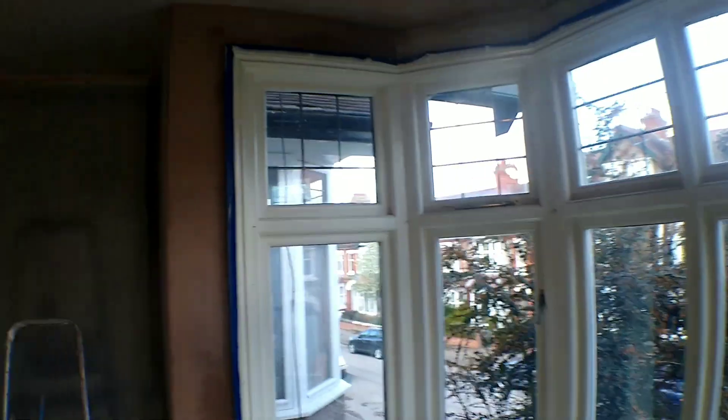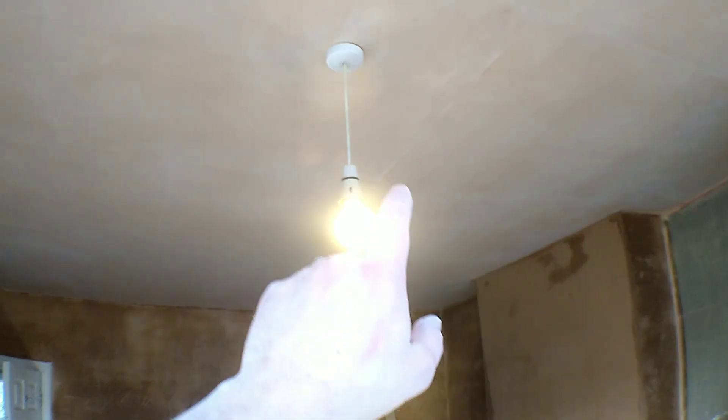That's what we've been doing. As you can see, this master bedroom is almost finished, and you can see this ceiling drying out. This ceiling has been overboarded with a 9.5mm plasterboard because it was papered, and it made more sense rather than spending hours and hours stripping the ceiling and priming it all. In this case, we just overboarded the ceiling. So there are two options for you if you've got lath and plaster ceilings and walls.